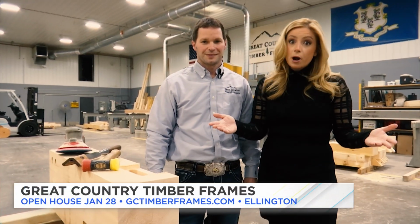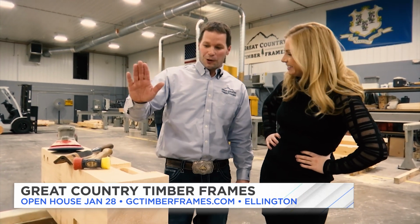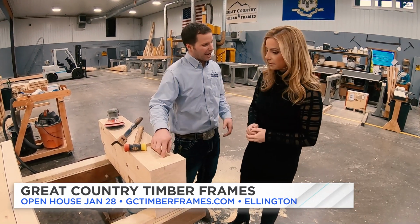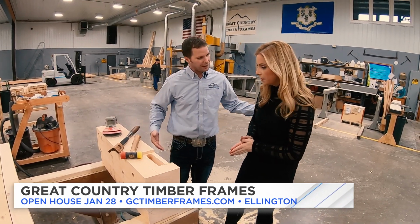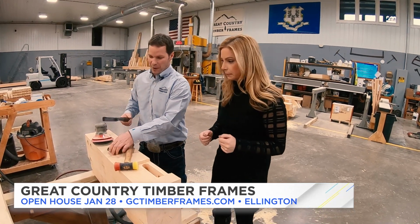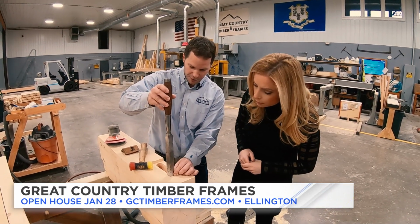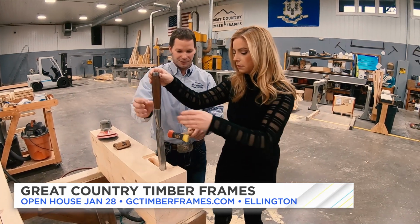So now that I'm a pro, they want me to try a couple of other different projects here. So what is this? So this piece just came off the CNC machine, Taylor, and we're asking if you can cut out these corner pockets and make those squared off instead of rounded with these chisels. Okay. Is that something you can help with? I think so. So how does it work? All right, so this is a special tool. This is a corner chisel we use in timber framing. Yep. So you're going to put this right in the corner of this rounded pocket and a couple light taps with the hammer to get that chiseled off.